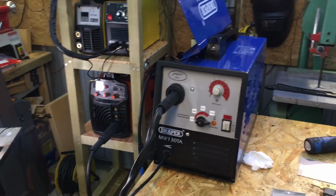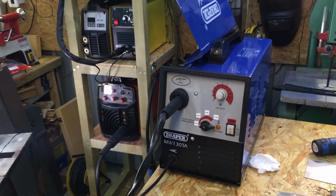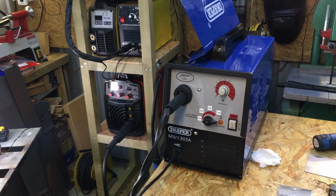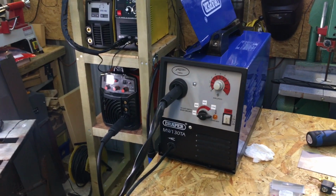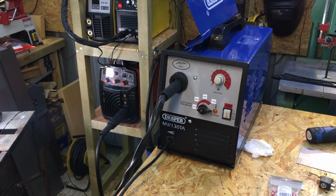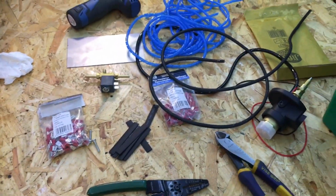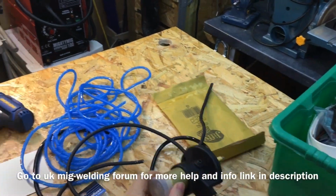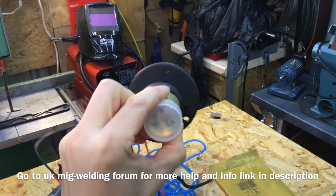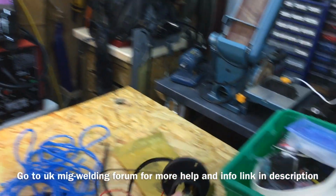Alright, so here's my little welder, which I'm going to be converting to a Euro torch connection. So first off, if you're going to attempt this, make sure you know what you're doing, because there is mains voltage inside here which could potentially kill you. The bits that I have bought, I will try to put links in the description to them. But the stuff that you're going to need is obviously the Euro torch connection there, which will fit on your welder.